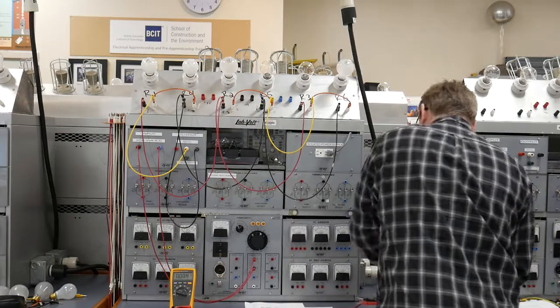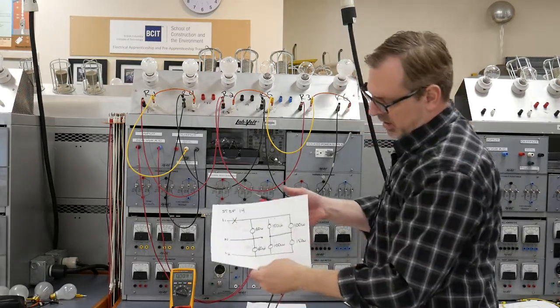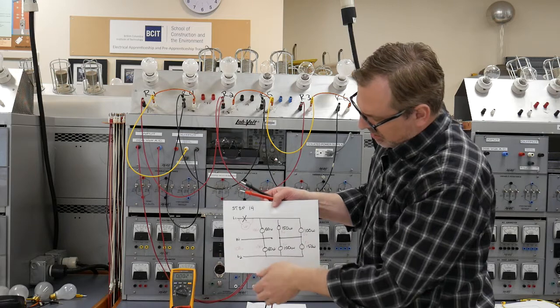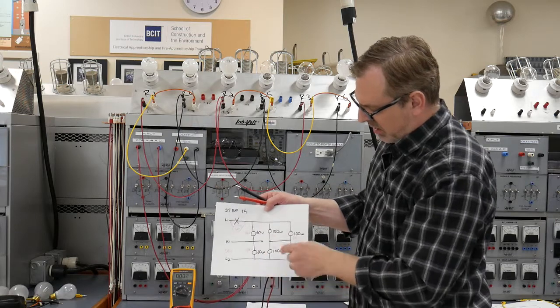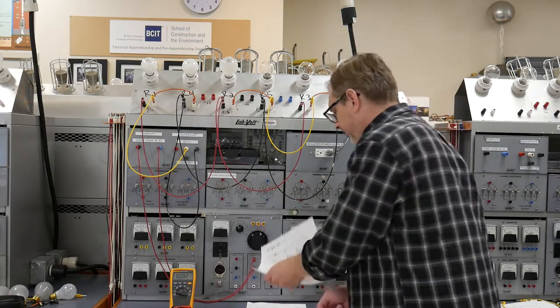And by removing jumper J2, what they get us to do is create a combination circuit out here that goes from line 2 all the way back through the R1 to neutral. So we're going to see a substantial voltage out here at the 60 watt bulb and next to nothing here. I've anticipated 5 volts at each of these and 98 there.